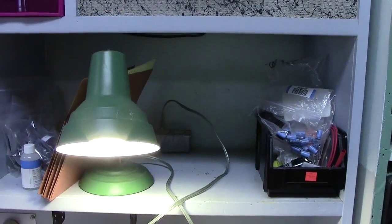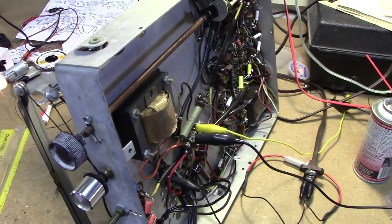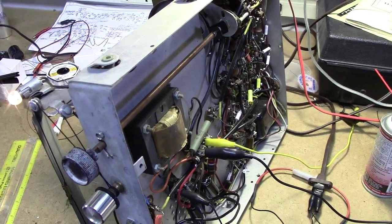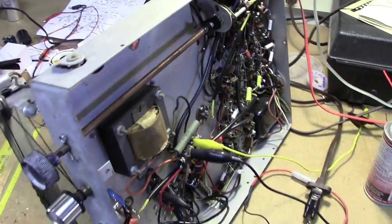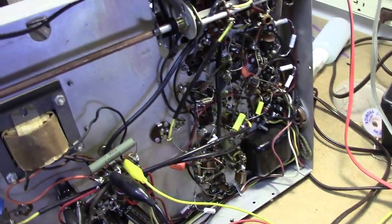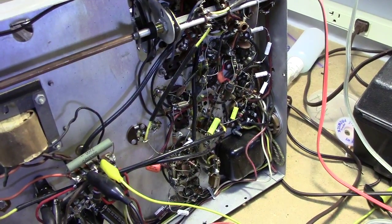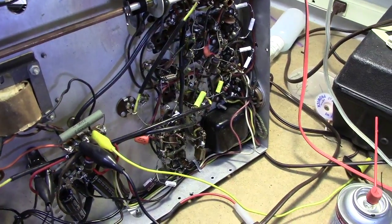It's that mica ends up becoming, I don't know exactly what the failure mode is of the mica, but somehow, due just to the corrosive effect of things in the air, the mica gets tarnished, or not the mica, but the silver layer on the mica gets tarnished, and somehow it becomes conductive, so that you end up with intermittent shorts.